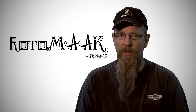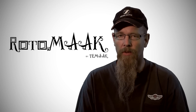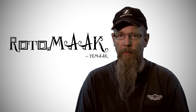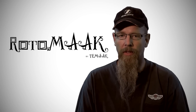I had made some salesman samples of a large rotational cast part, and the customer wanted a smaller version for his salesmen to take. We were able to 3D print a sample — the first one took about 12 hours to print. After that, the customer wanted 10 more and we needed a way to relatively fast reproduce this part. After research online, there was no desktop rotational machines available to do this.